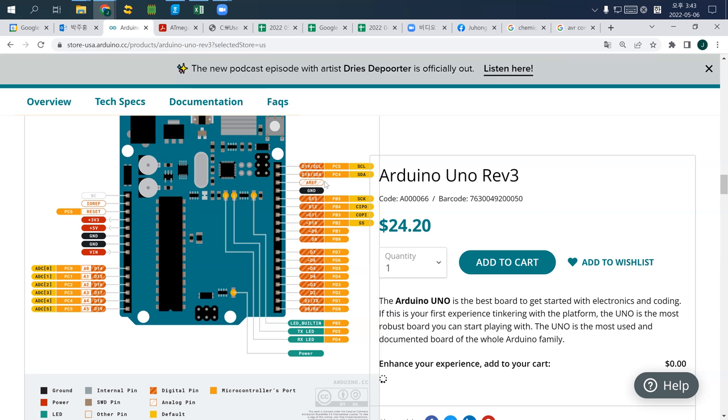But you can also connect them creatively, like how to connect digital input to analog output. There are four buttons, 1, 2, 3, 4. You can use multiple digital buttons for completely dark, dark, brighter, completely bright. So this one is using four different digital inputs to get an analog output.